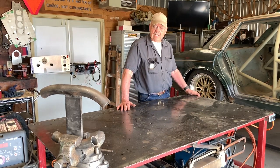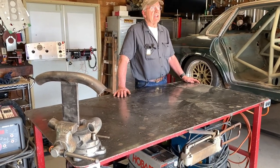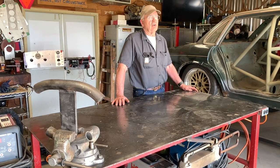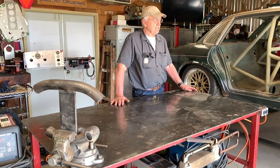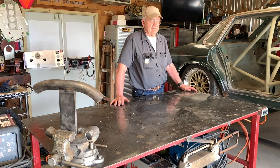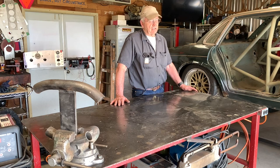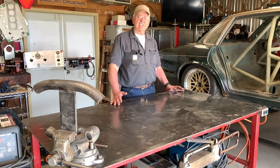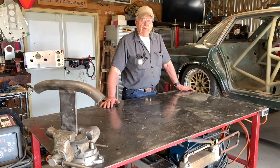What is this thing? First of all, it's made out of steel. If you're working on a wooden bench right now, you know how hot metal and wood works out. It can be made to work, but it's not the best. Wood tends to deflect as metal cools, and we can do better. So the top of this bench is made out of quarter-inch thick hot rolled steel.